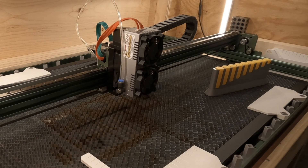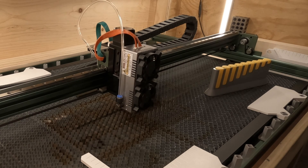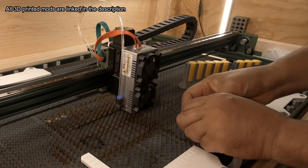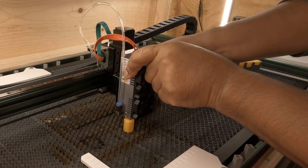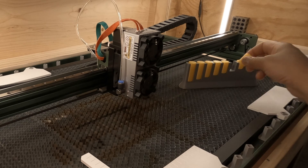I won't get into too much about the Z-axis, but as far as setting my focus zero height, it's simply a matter of homing the Z-axis. Then I'll raise the laser module up a little bit high just for safety, and then I'm going to send it down to my focus point, which on this machine is going to be 44 millimeters from home. Then once it's there, I'll use my height setting gauges — I designed these and put them on Thingiverse a while ago, I'll include a link in the comments — and set it 25 millimeters from the body of the laser. So I'll loosen up the thumb screws, drop it down until it touches, tighten those up, and there's my focus height. I'll just home my Z-axis again. Gotta say I'm a huge fan of that. Really easy, really repeatable. Very nice.